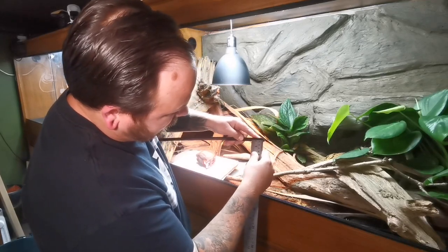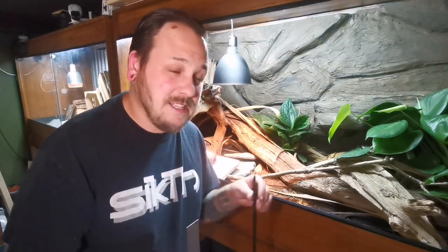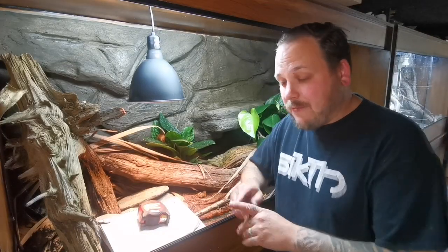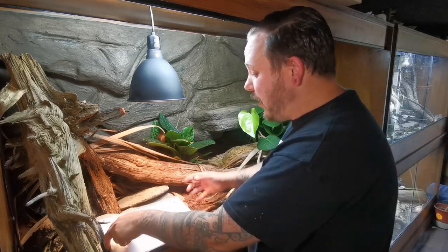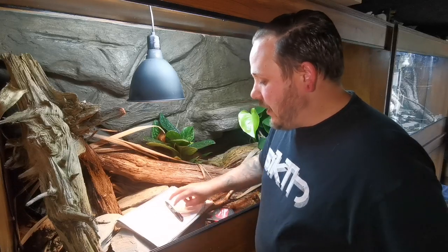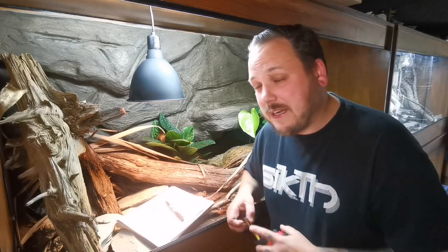In my case I've got five millimetres. Everything in this video is going to be in millimetres — I'm a UK-based channel and a UK builder, so I work in millimetres otherwise it gets really confusing. The same technique applies, you just have to use inches rather than millimetres. So now we know the track depth is five millimetres, we make a note of that. Now we need to measure the distance between the two tracks and write that number down.